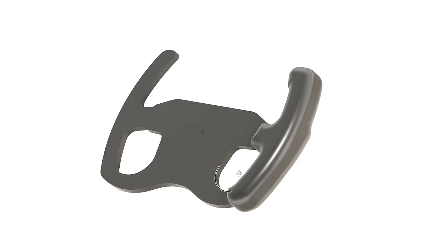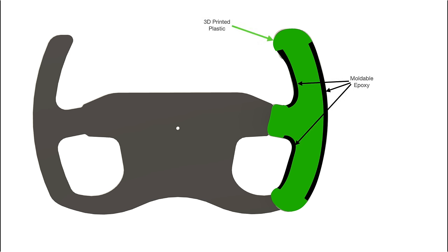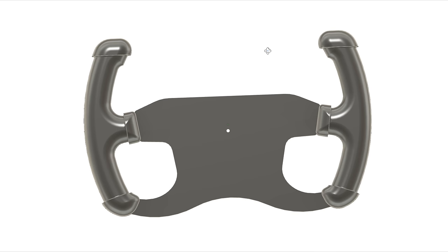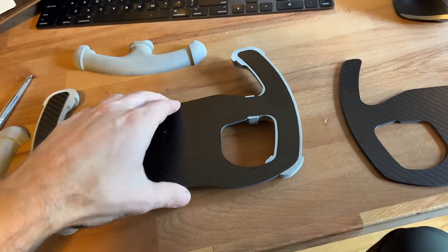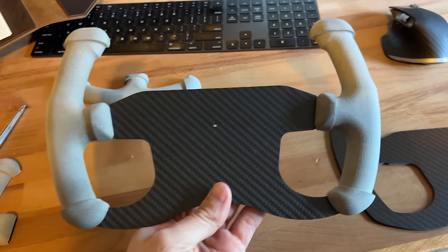For the grips, I made them in the same style, pretty much copying what was scanned earlier, but I did undersize part of them in the middle so we can add material to make custom molded grips. The idea is that we have the tips of the wheels at normal geometry, but we shrink the middle so we can fill that in with some pliable molding epoxy, then mold that part to Robin's hands. So I drew that up in CAD and — hmm, that looks like a penis. I have accidentally made dildos for steering wheel handles. Screw it — let's send it off to be 3D printed. When the 3D printed sex toys arrived a few weeks later, it was just a matter of snapping them onto the carbon for a test fit. Yeah, that looks great. Totally inappropriate, but great.